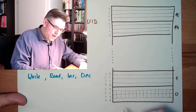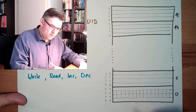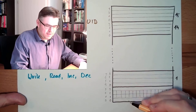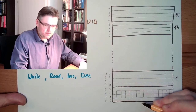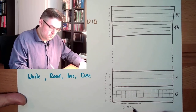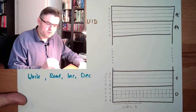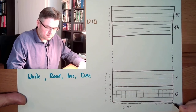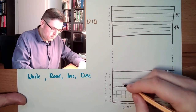Why haven't I shown this here also? Well, the first few down here, here is the UID. It's between 4 and 7 bytes. This is the UID stored here, 4 to 7 bytes. Sector 0, block 0, first bytes, UID. And then here are some manufacturing data. And the rest is already usable to us.